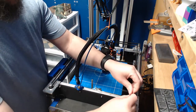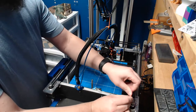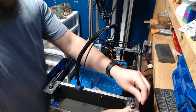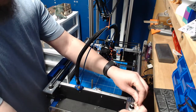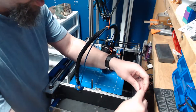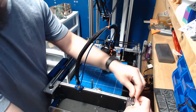Theoretically, it should install pretty easily. The biggest change will be the bolt sizes will be longer, obviously. Some things I know are not going to fit right now, like the X end stop, but I can just manually zero out X and print a new one, so I didn't worry about that. It's hard to say what other surprises I'm in for. Pulling this stepper off first.